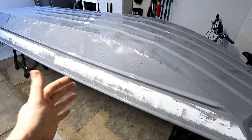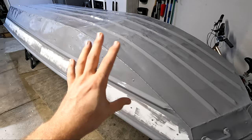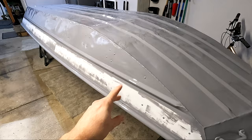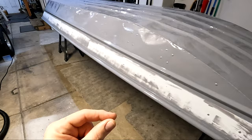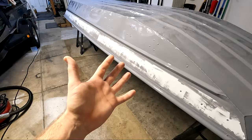So another coat down — it's going to get a lot darker than this. I notice as it dries, it definitely gets darker. Coat number two of the enamel is on. I'm going to let this dry overnight and then see if I need to do any touch ups. I'm really happy with the coverage. This much painting on a 14-foot boat took one quart of paint. I would say if you're doing this on anything larger than a 14, start with two quarts, and if you're going to be doing the inside also, you're going to need at least three to four. But at $15 a can, it's a lot more reasonable than $25 a can. First impressions are pretty awesome.